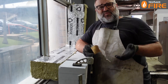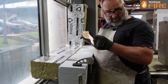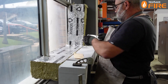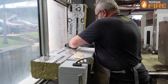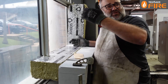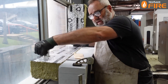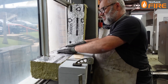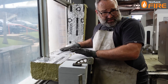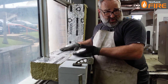Okay, one of the last steps: wherever there's a butt joint, we don't need to use sealant because it's messy and dirty — we can just do a dry fire and smoke seal by taping up the butt joints like so. The CWFS comes in 1.2 metre long lengths, so every 1.2 metres we'll have a butt joint. Tape up nice tight butt joint on the top — and it's quite strong under compression. Stone wool is impervious to water absorption; as long as the building dries out, the Siderise will dry out and it's good to go.